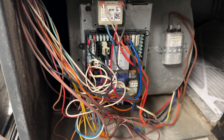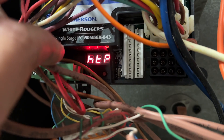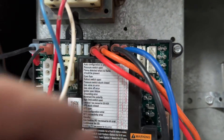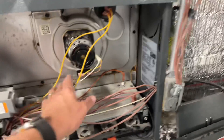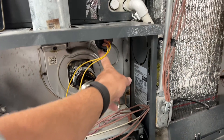Got a lot going on there — snap, crackle, pop. If we look down below here, we have this Emerson White-Rodgers integrated furnace control, and we are looking at an error code of E01. Looking at our diagram right here, E01 means pressure switch open. So that means our inducer assembly should be getting power, creating pressure, and closing the pressure switch.